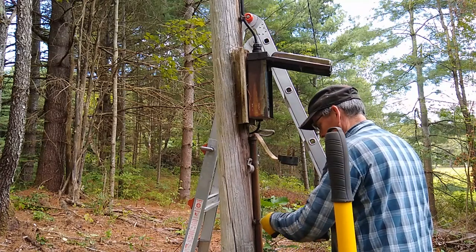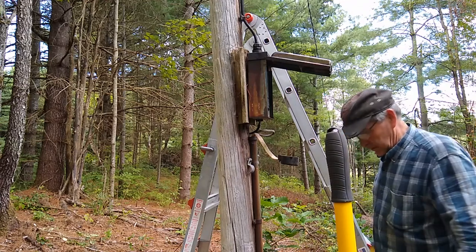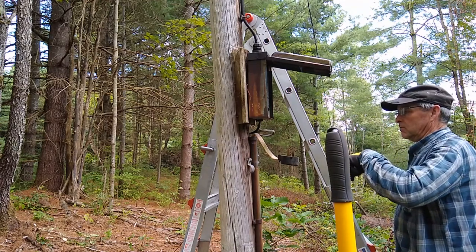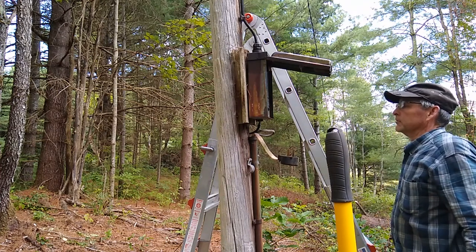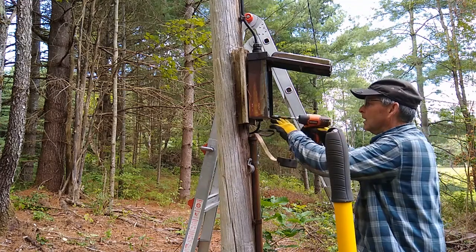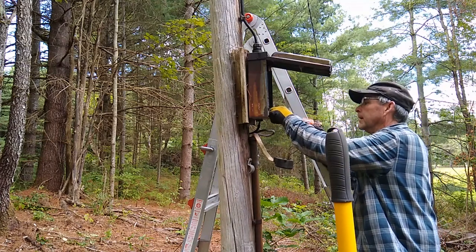I'll probably reuse these. I'm going to be using electrical PVC. Pick them up down into the ground, 18 inches I think is code. And I'm going to be burying the new, well, this existing cable I'm not going to do anything with, but the new cable going over to my spot where I'm going to set the RV up, I'm going to be down 24 inches with some tape in the hole so somebody's digging, they don't dig up my cable.